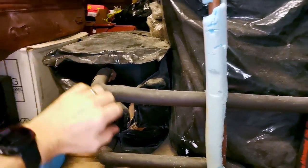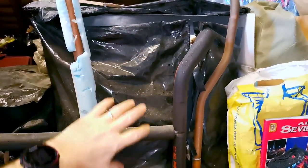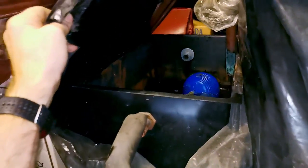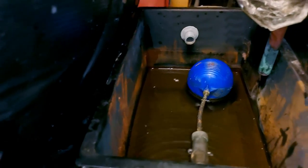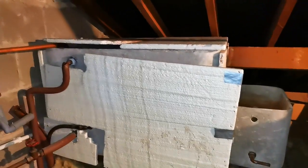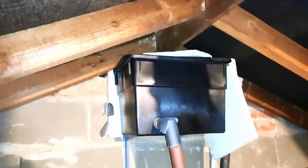Now the first thing to point out is that these tanks aren't always in the loft. These two tanks — the large one is the cold water storage for the hot water, and then this is the F&E tank, which stands for feed and expansion. This tank feeds the central heating and takes up the expansion of the water in the system. Here's another large cold water storage tank made of asbestos, and up in the eaves is the little feed and expansion tank. I want to point this one out because it doesn't have an open vent pipe — that 22mm pipe coming up and over the top into the tank. This is perfectly acceptable in the right circumstances — any engineers thinking that isn't correct, just look it up in the building regulations.